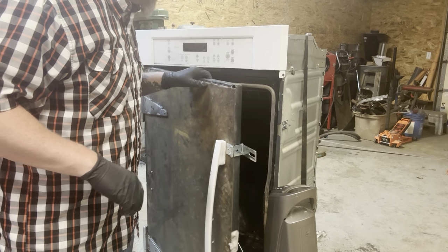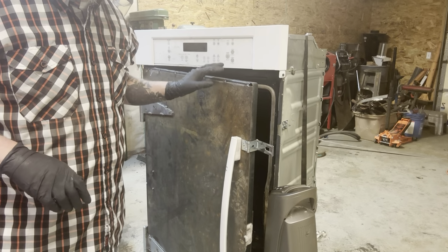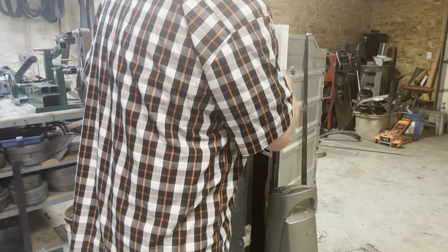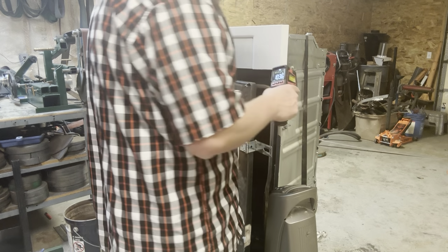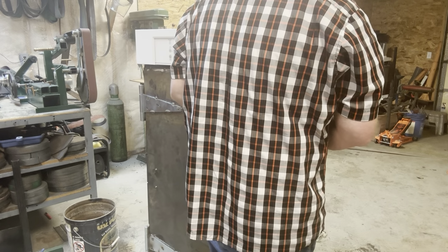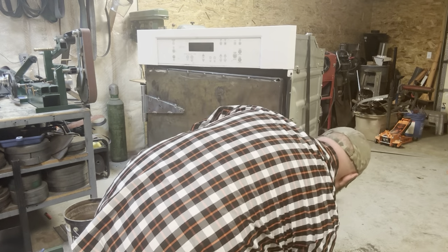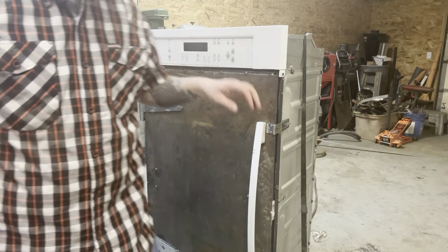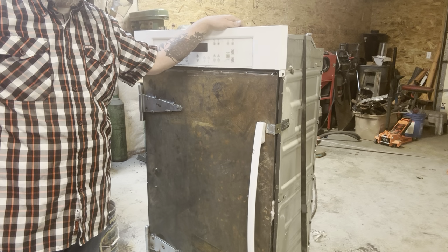All right, so we've got the heaters in there. We've got the barrel hung in the middle, and we're just going to let this run for about 10 minutes to get that up to temperature. All right, so we're sitting at about 110, 114, 110, so we're good to switch over to our steam method now. So it needs 10 minutes to start producing steam. We're just going to raise this up. All right, so that's going to produce steam inside the box. Needs 10 minutes to heat up. I'm going to go ahead and leave it for an hour total and we'll be back.